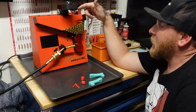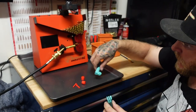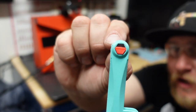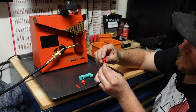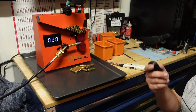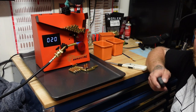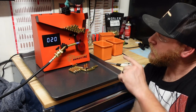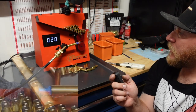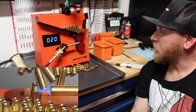I realized my camera's not going to get the best view from up there, so I 3D printed some parts to help — this is just a simple GoPro mount. It's actually a really great design; the guy that did it did a great job. It uses a half nut, super easy to install, has nice little thumb nuts. I'm going to swap this onto the camera so you guys can get a better view. I've slowed down the annealer from 25 that I was running previously down to 20, which seems to give me a lot better results. I've also adjusted the flame and I'll add the GoPro close-up in the corner so you can get a better idea of the flame location.